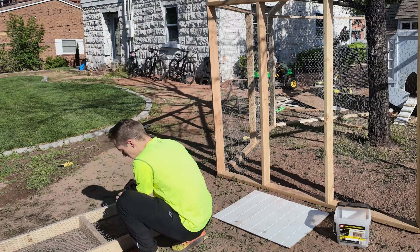We ended up designing what I describe as a collar of six small 2x4 pieces that are all attached together and then screwed into the tree with one screw. This creates a very sturdy support for those other 2x4s without causing damage to the tree.